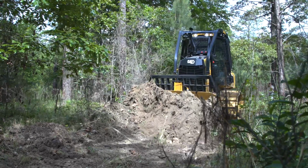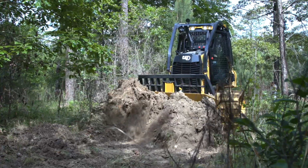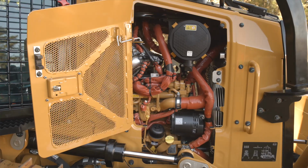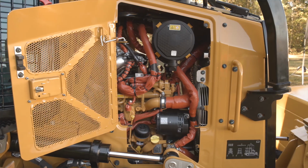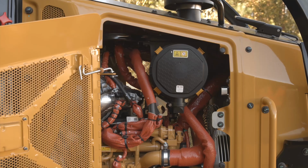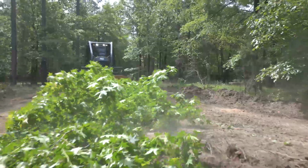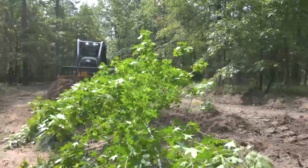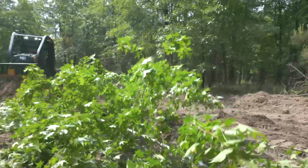An extreme duty bottom guard protects the bottom of the machine, and a hinged radiator grill guard provides easy access for cleaning excess debris. Fire protection sheathing on the engine harness, fuel lines, and critical electrical wiring, and fire sleeve covers on coolant lines, diesel exhaust fluid or DEF lines, heater hoses, and hydraulic lines ensure they are free from damage. And the air intake filter also has fire arresting elements, safeguarding it from fire damage. Finally, a steel hydraulic tank, stainless steel fuel tank, and manual shut-off fuel valve provide extra protection.